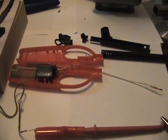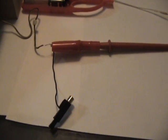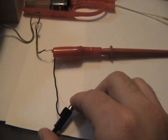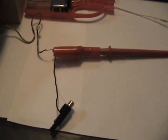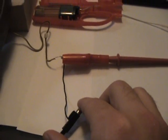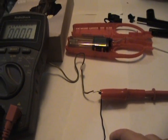The first application I will be talking about is a household lighter, which you can see I took apart. All the pieces are shown here, and the part that you actually squeeze to create the spark is shown here. This holds the piezoelectric material — there are several different types including crystal, ceramic, and even wood, but most likely this has ceramic or crystal material in it. I have it hooked up to my multimeter to test the voltage produced whenever you compress the material.